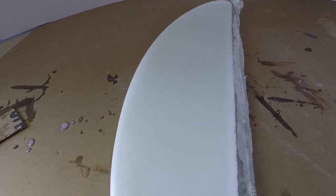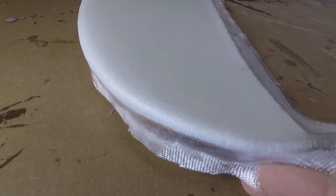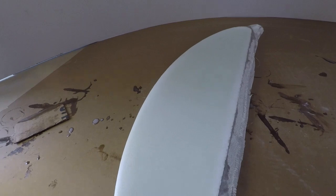All the layers are on there, everything's looking great, evenly wetted out. You can see the trailing edge and what the tips are looking like right now — the glass is wrapped nicely down to the tape on the leading edge. As this starts to set up and get tacky, I'm going to make sure it's still hugging the leading edge very nicely. You can just come and stick it down as it starts to cure. The tips are harder to manage, but once it gets a bit stickier you can start to shape it and get it to hug the tip the best you can.